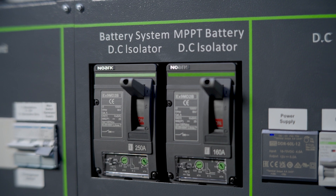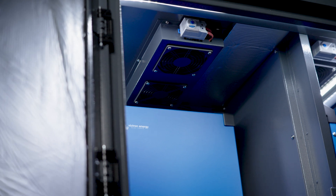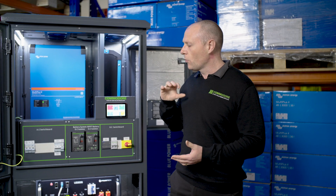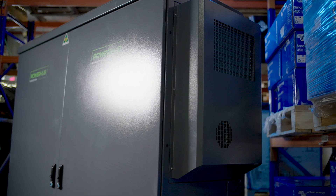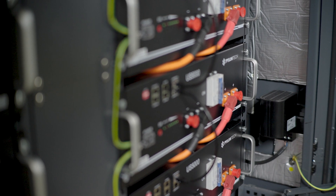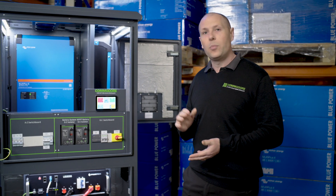We've got our main DC isolators — your battery isolator and your MPPT. One of the main features of the PowerHub is the IP55 rating, which gives you great flexibility with installation. You can install it inside or outside — it's dust proof and rodent proof. It's temperature controlled: it sucks air in and pushes air out, and when the system gets too hot the fans kick in automatically. We can also add a temperature-controlled air conditioner for extreme circumstances like North Queensland, or a heater for very cold climates. Keeping your electrical equipment at temperature can add two or three years to the back end of your system.